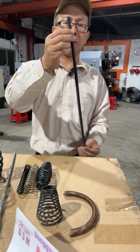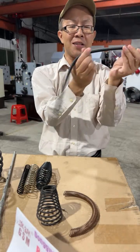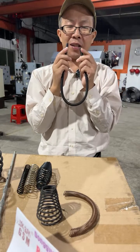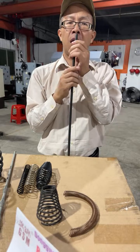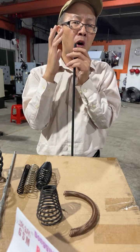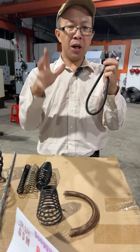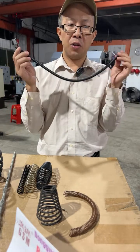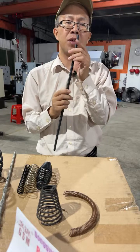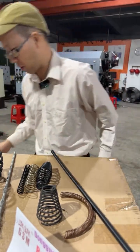This is a sleeve spring. With the sleeve spring, every loop is contacting each other without any gap, even though it is very hard to make them contact. The sleeve spring is widely used in high temperature or high humidity atmospheres to protect cables, signal cables, or detecting cables or wires, like in cars nearby the engine side. Also in household water meters, with sleeve springs made by our compression spring machine.